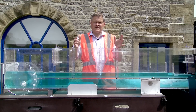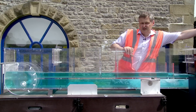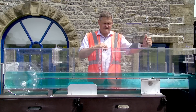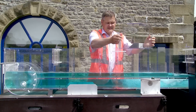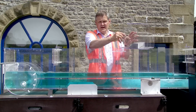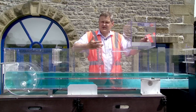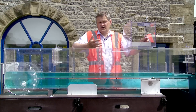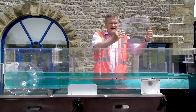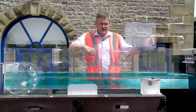What I'm going to move on to now is the effect of building things in or across the channel, and I'm going to start with weirs. This is a broad crested weir — five centimetres high. It is called broad crested because the crest is fairly broad. Weirs are put into rivers to raise water levels: either to make a river navigable, to allow us to abstract water, or — the most common historical purpose — to drive mill wheels. I'm going to put this section in and I want you to observe the effect it has on water level and also the speed of flow.